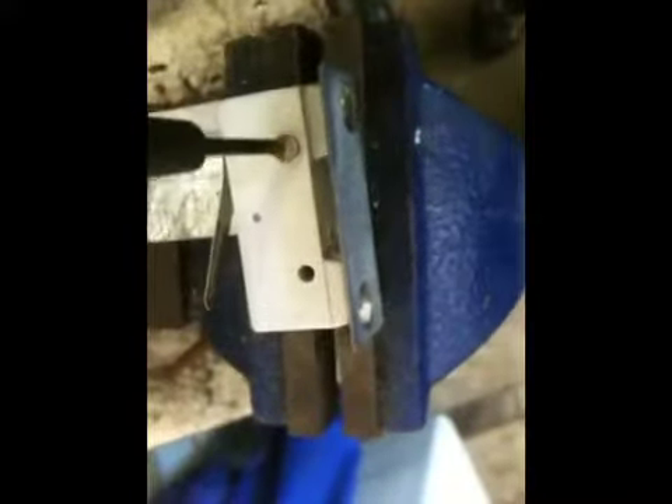Here we've got our new microswitch fitted to the bracket, and we're going to go ahead and tighten this up. We've got our nuts held in by the vise here. There's an adjustability scale in this switch — it can actually rock up slightly in the chassis or rock down, and we usually set it right to the middle or closest to the top.